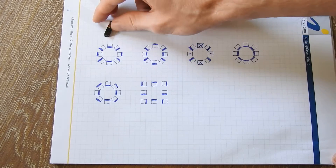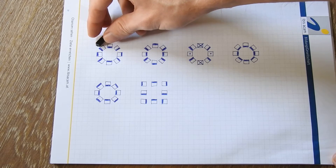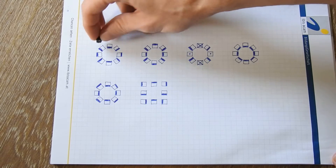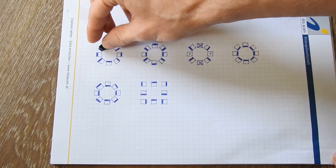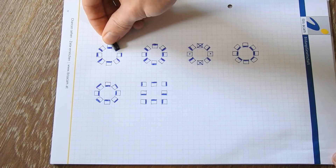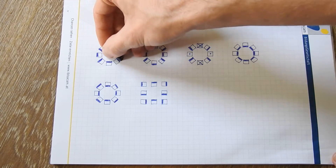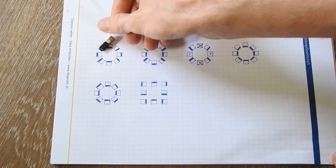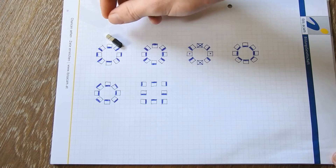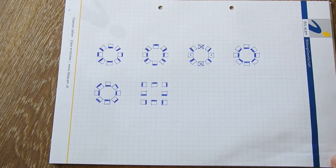This array shapes the field so that it focuses to the outside — you get a big field on the outside. Viewed from the side you get a nice symmetrical field from each side. The way you arrange this: I take this stack of magnets — two are covered in black tape so you can see it better. We place the first magnet and then arrange them in a clockwise direction. But the magnets themselves we rotate counter-clockwise, always 90 degrees for each position. That equals a field focused to the outside.